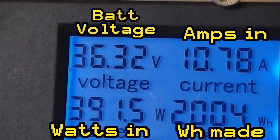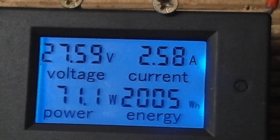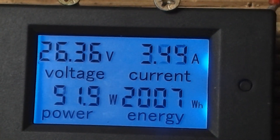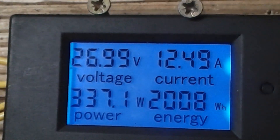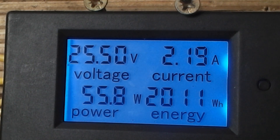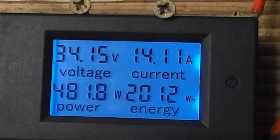That's better - dump load on, I want to hit a kilowatt! She is a beauty, my friends. I've got the dump load drawing off 300 watts off the battery. We don't have any kind of controller plugged in, we're just testing it through the bog-standard rectifier. We've got a cheap setup here - a £10 rectifier, a £10 meter, another £10 meter. But that power's coming in! The dump load actually seems to be controlling the speed of the turbine. Whoa, 500 watts - come on!